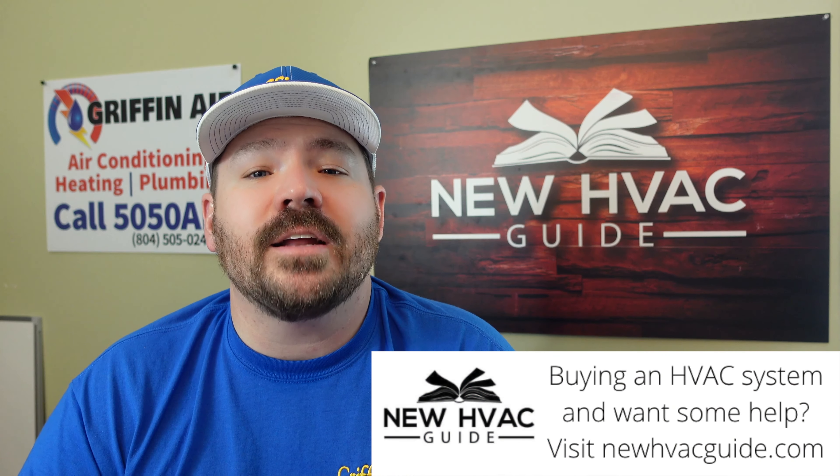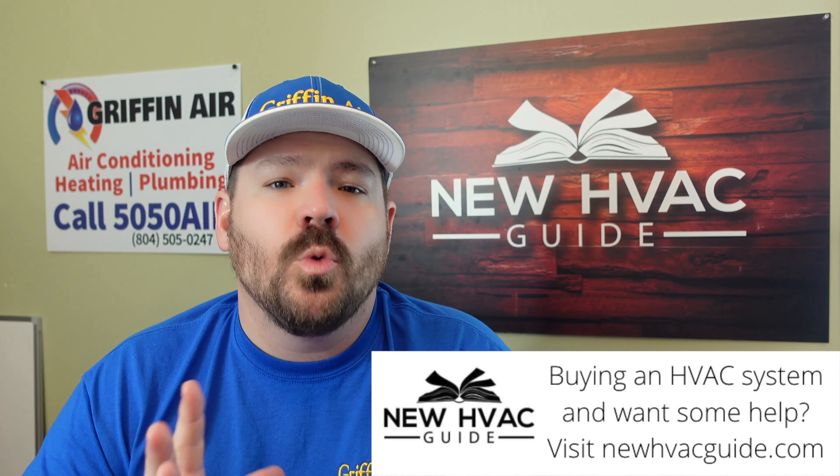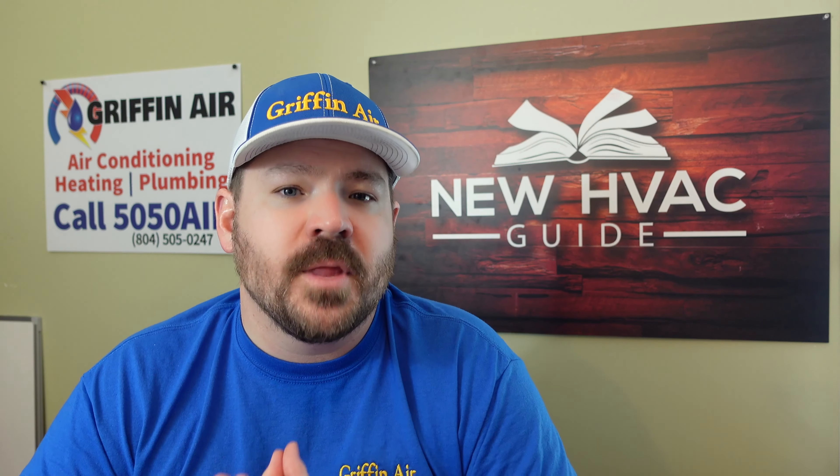What's important to understand is they don't operate the same. In most scenarios, when you have gas backup for a heat pump, we call that a dual fuel system, and they operate by measuring the temperature outside and will lock out the outdoor unit and run off of gas. But if you have a heat pump with electric backup, most times it does not operate that way. In fact, in a lot of cases, it doesn't even measure the outdoor temperature — it doesn't care. It's going to operate the way it's going to operate regardless.